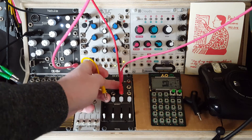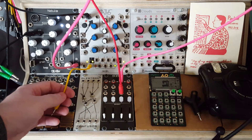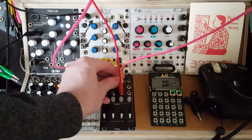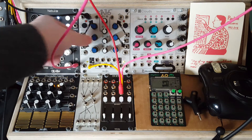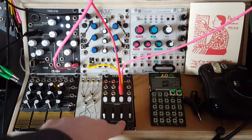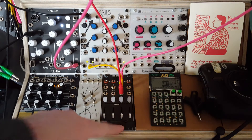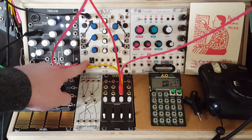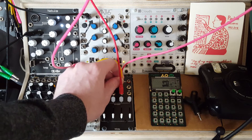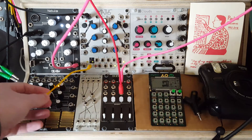This isn't going to achieve what we want. This is just typical VCA usage where the VCA is closed so no audio is passing through, and then the control voltage from our envelope is opening the amplifier and letting the audio through. It's just the typical way that we'd use a VCA.